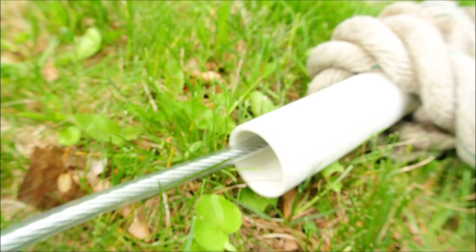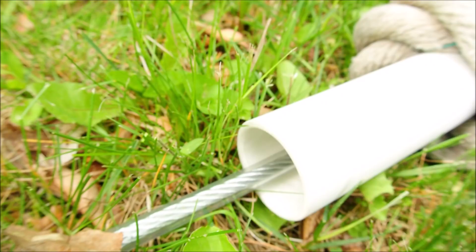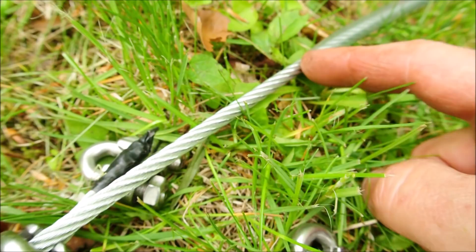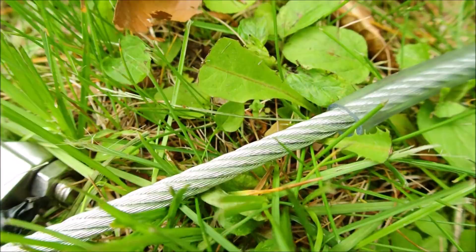The PVC is one and a half inch inside diameter, and its length is 36 inches if I remember correctly. Inside this piece of PVC, the vinyl jacket is 12 inches longer than the PVC. Why does it stop short? Because if the entire length of the wire cable is encased in vinyl tubing, then if water should get inside it can't easily get out, and the cable will more quickly rust.